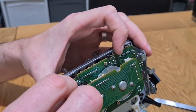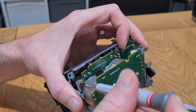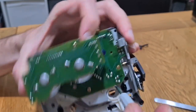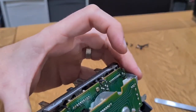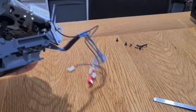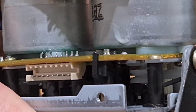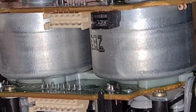That's pretty straightforward — you're kind of halfway there. I know I've still got to clean all the gunk off the main drive capstan and motor. If you're just doing a service, this is honestly maybe a half-hour job once you get it down to a tee. I do quite a lot of these now. I really like this deck — it's great to service, it's pretty well put together. People complain about it being a 90s deck but I like them. Now you can pop your belt on.